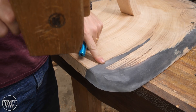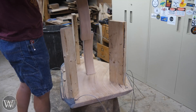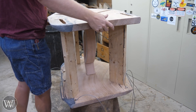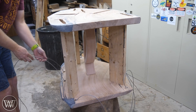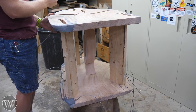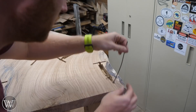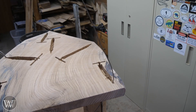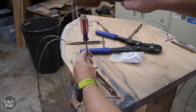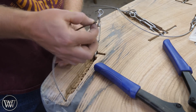Then we can put in the little hardware eye pieces that the cable will go through into the bottom slab. Using an aluminum dog actually worked out pretty well to pound them in without damaging them. We have three spacers set for the correct distance apart — actually ever so slightly less than the correct distance apart — so we put the cables through, then I can pull up the center cable which will take the weight off of the outside stanchions. We're going to pull all the cables up through and start doing all of our hardware connections.